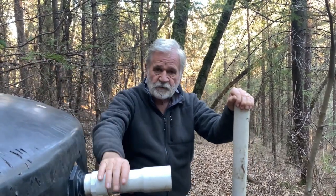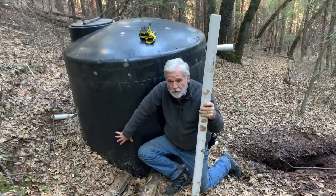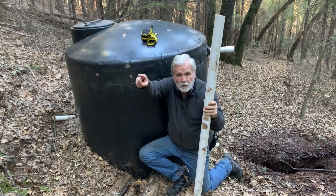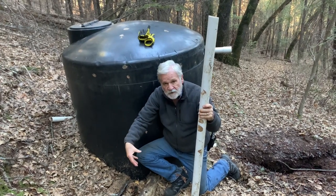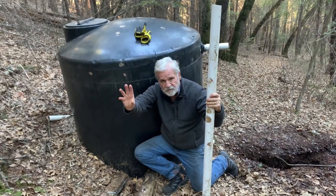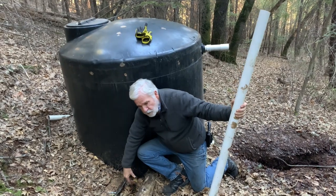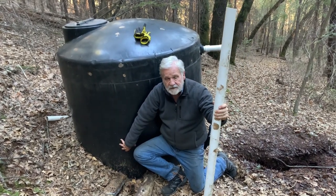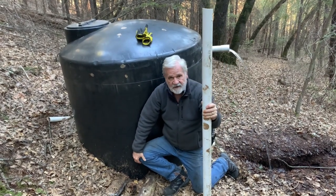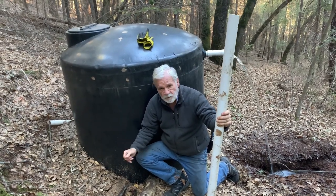What we did have to adjust is the water going into this tank. The water for our storage tank comes from a spring about 200 yards up the hill, delivered by a two-inch PVC pipe like this one. We can control the amount of water from the dam with this gate valve here. We found that if we open it two full turns it provides plenty of water to fill the tank with a little extra coming out of the overflow spout, so we have plenty of water when we take a shower, wash, or do the dishes.